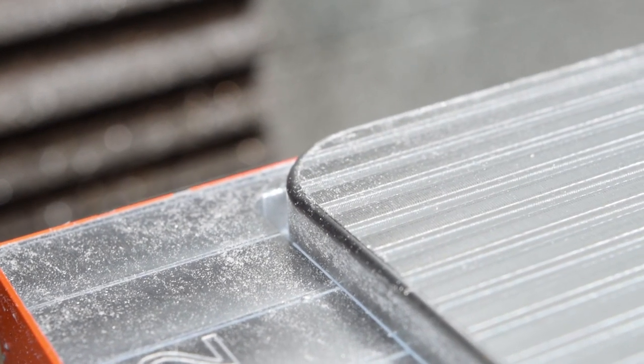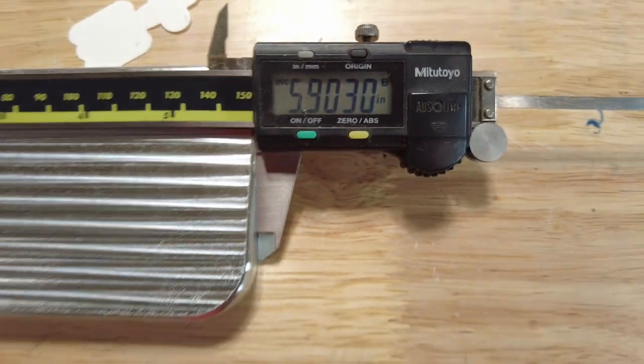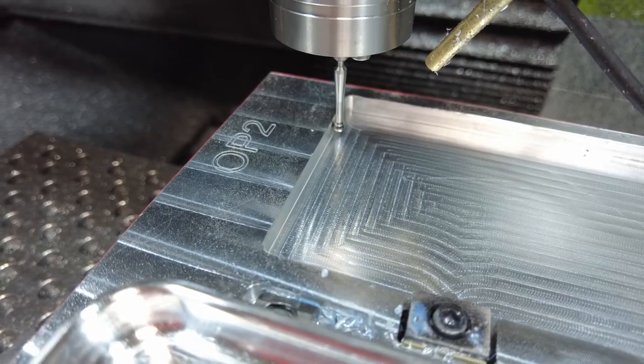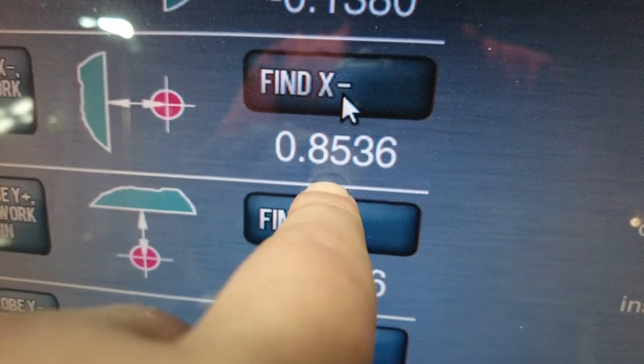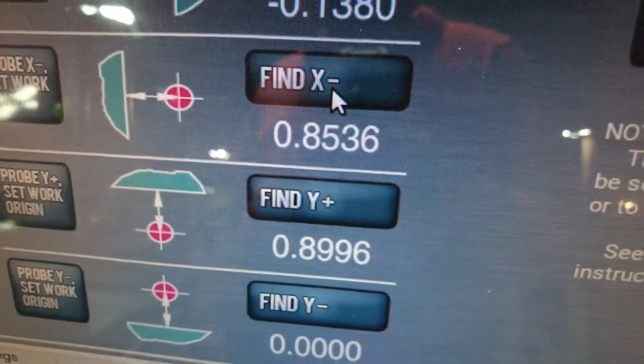And this fillet over here seems a little deep. The tray itself is only three thou oversized, so that couldn't be the issue. I used the probe to check my fixture — this should say 855, so we're only about a thou off. So that's not the problem. I just checked CAM and honestly, I don't have a clue what the problem is. Everything should be working right. I'm just going to hope it was like old code or something, so I just regenerated it and reposted it and hopefully that fixes it.